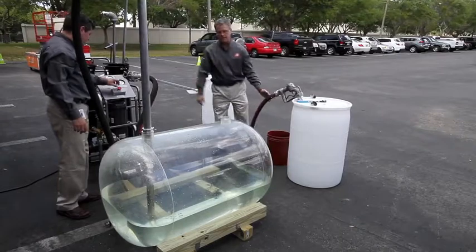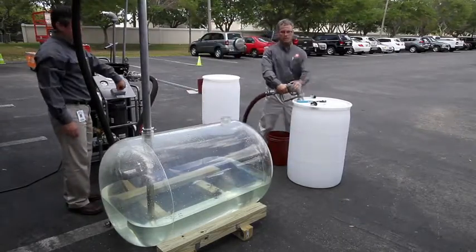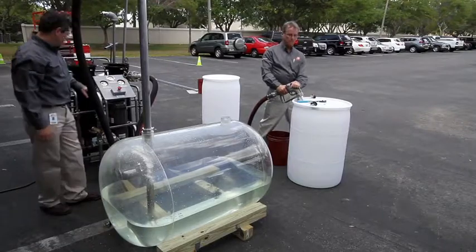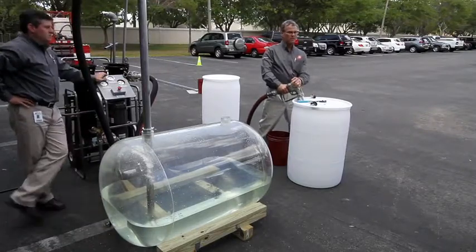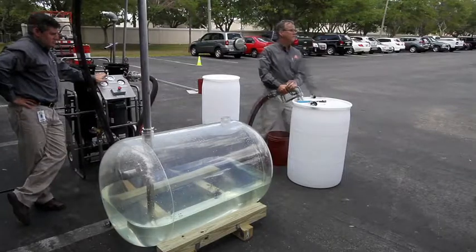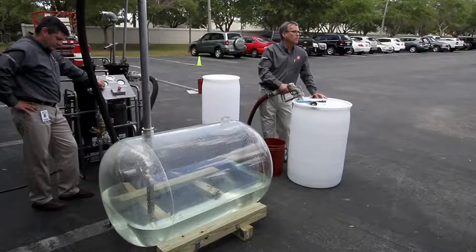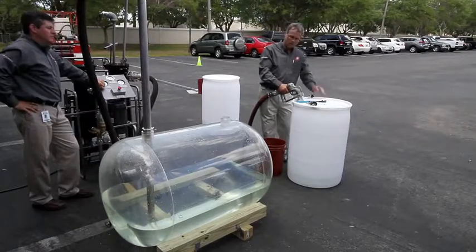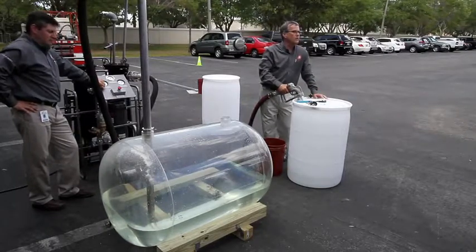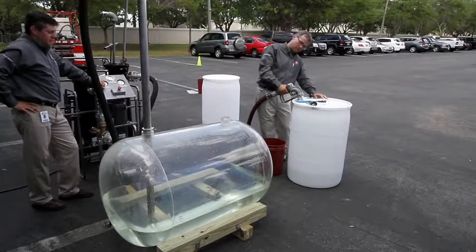One of the steps is to take some fuel out of the system and get the level down to about four or five inches, so the GammaJet can work through the whole surface. You can see that if you put a GammaJet in there and you had it all the way up to the top, you'd only be doing three quarters of the tank.